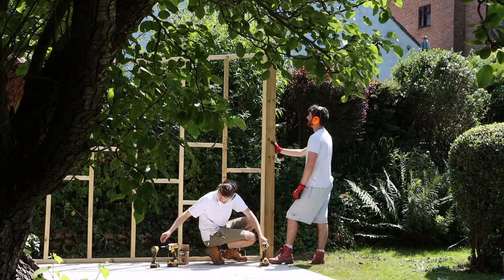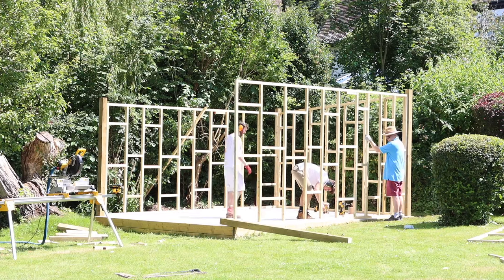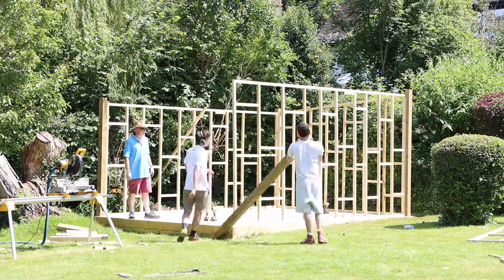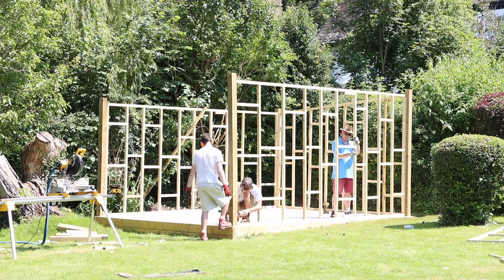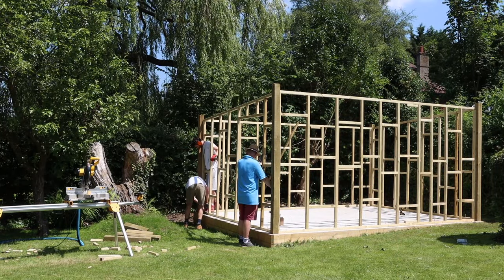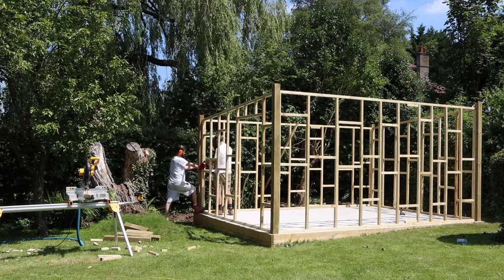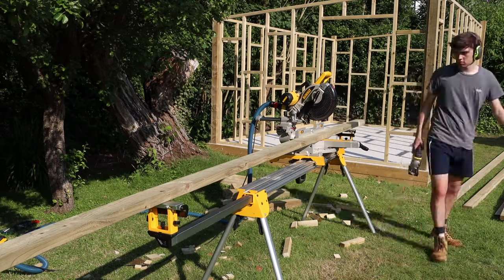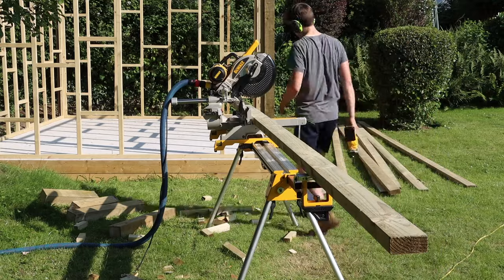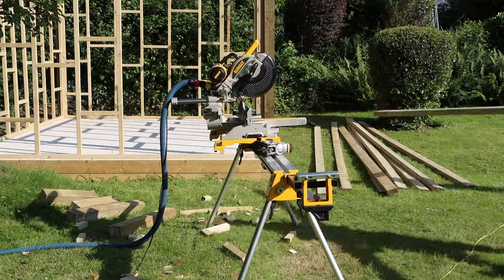If any of you have thought about building an outbuilding, a shed, or a timber store in your garden, this is a really easy way of doing it — just making four walls and screwing them right into the fence posts. The good thing about this is it's not fine woodworking, so it doesn't matter if there are tiny gaps or something isn't exactly square — it's still going to work at the end. Obviously you do want to try and make things square and level, but don't beat yourself up if it's slightly off. Now with the roof beams, which are made from 2x4s, I'm cutting some notches out of them — that's going to help the beams slot onto the top of the walls and sit nicely in place. Without the notches they'd have more chance of wobbling back and forth. I cut one beam out and traced that on all the others so all the notches were cut in the exact same place.